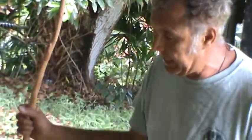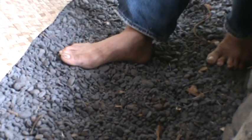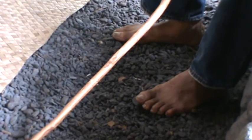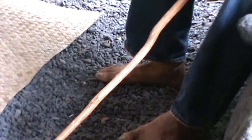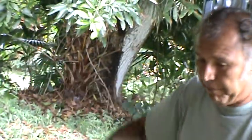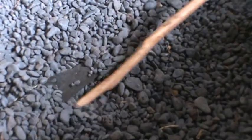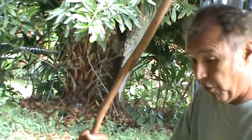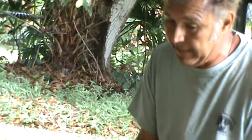The floors were made with this ili, this particular kind of gravel here, and we're going to go to the beach where they have the different gravel sizes, where you can see the difference, and they use it differently. Basically this particular floor, on the bottom I use cinders. If you look under here, there's this cloth, which is like a weed barrier. It actually can breathe. Felt. If you put water there, the water just breathes. The floor is graded from the top where you're sitting, and it grades down to a perforated drain pipe underneath the floor, and then it's covered up with that cloth.